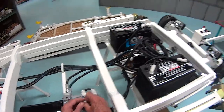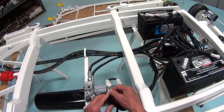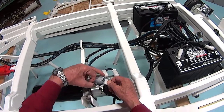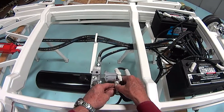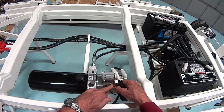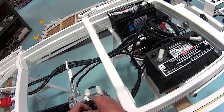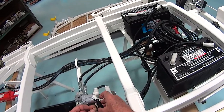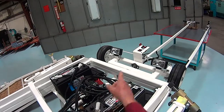There are three wires in the cable that travel to the handle. One wire is black and goes to this connection on the top of the solenoid. Another wire is white and goes to this connection on the solenoid along with a heavier wire from the battery. The third wire is a green wire, and that wire is inside this loom and goes directly to the lights.